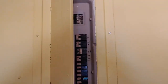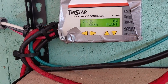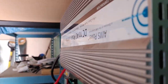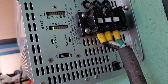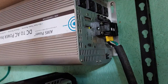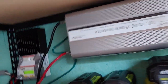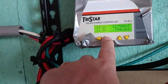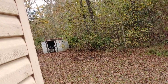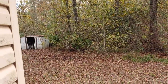Let's go out and turn the water on and see what happens. We are at 14.3 and the inverter is on, all connected. Here we go — we are about to start the test. The well has come on. We can see it start to drop there. We are now at 12.4 when the first motor came on, and we dropped to 12.4. We're going to wait a moment for the second motor to come on and see what happens.